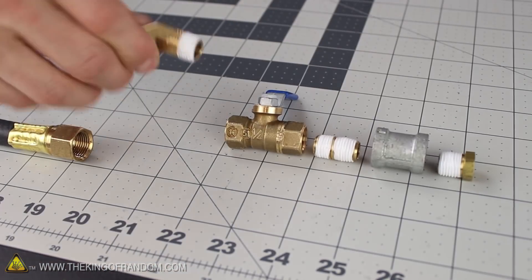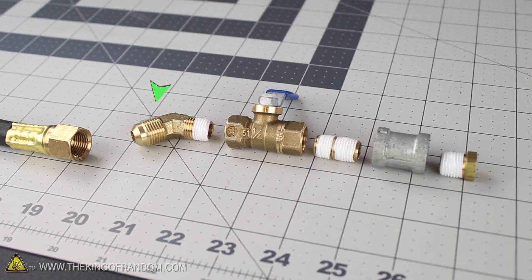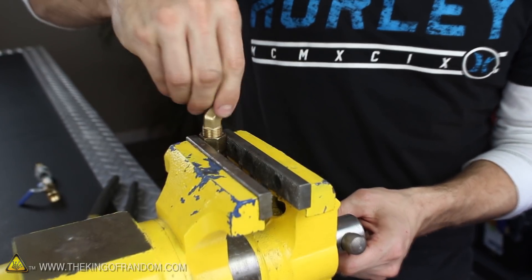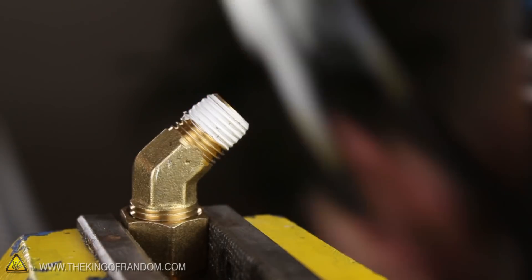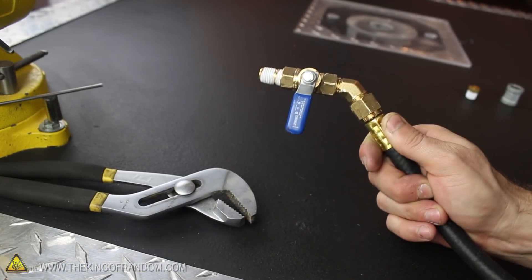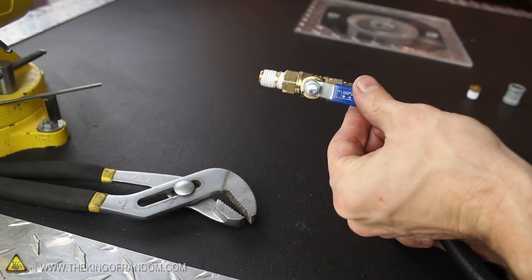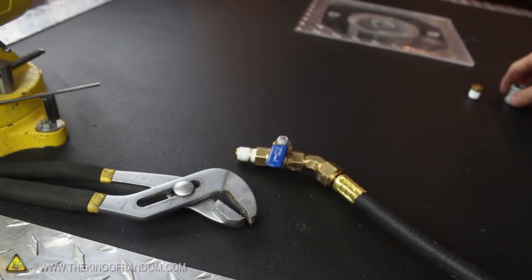This is pretty much the order the pieces are going together, so let's kick off the assembly by attaching the flared end of the brass 45 to the end of the 8 foot hose. Screw the fittings together finger tight, then use a pair of pliers to cinch them together so they make an airtight seal. Add the ball valve next, screwing it tightly together the same way, then screw the pipe nipple onto the end. It's important that the valve handle opens towards you and shuts off in the down position, so double check you put it on the right way.